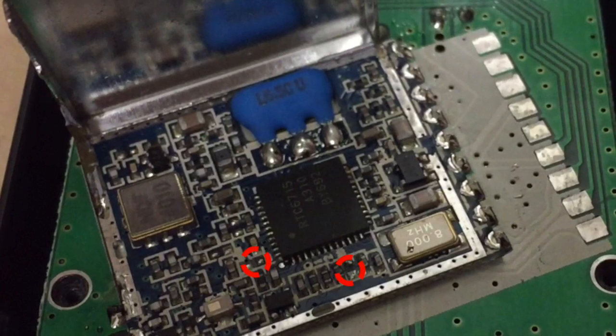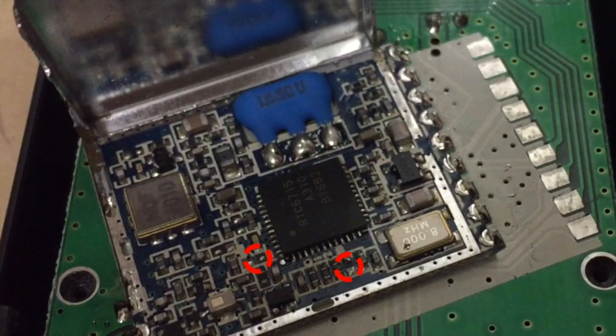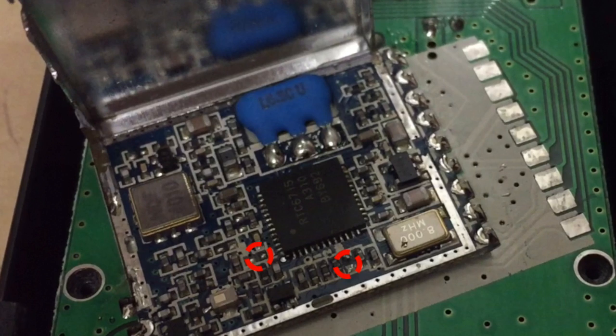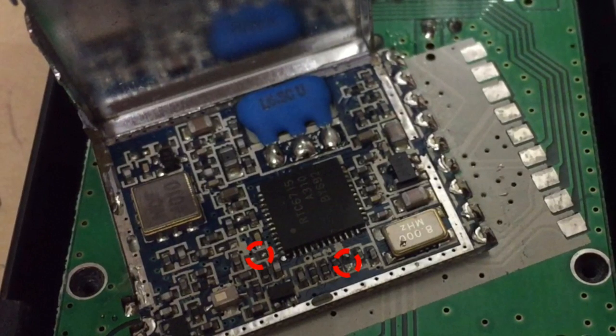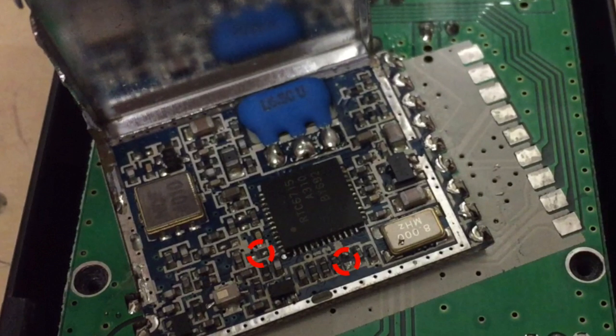We also use the A and B channels here. I think in the USA it's only A channels. So solder both of these points and you have a RC805 with B channel, A channel, or both — whenever you make it switchable by DIP switch. Thank you and have a nice day, bye.